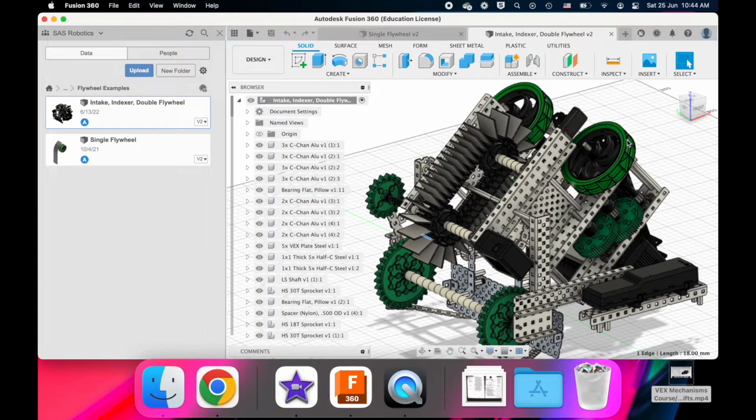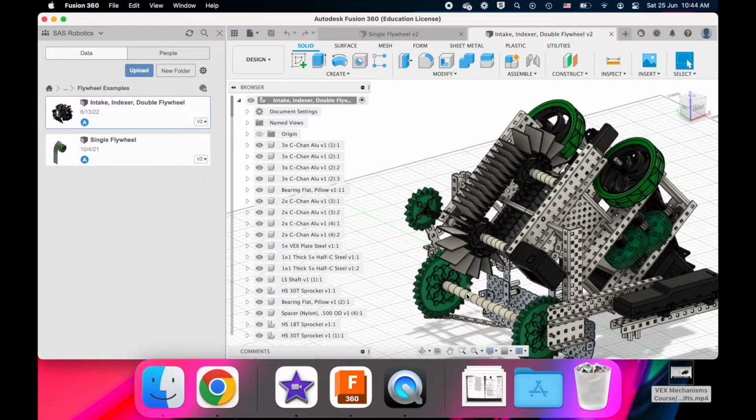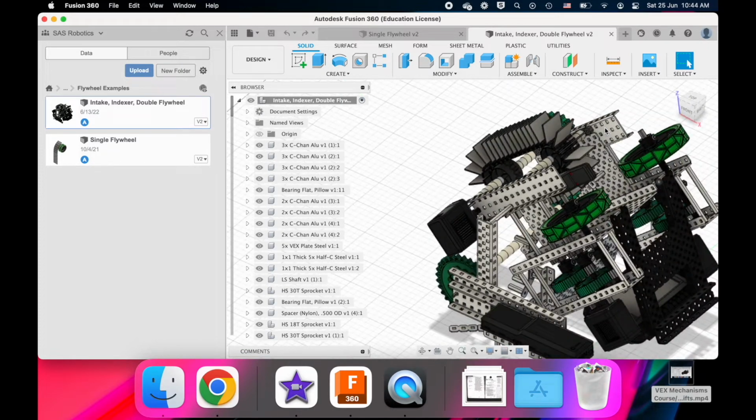And this year, for this game, for this robot, they had to pick up a bunch of yellow balls. You picked up the yellow ball in one location in the field, okay? But you don't want to fire it immediately necessarily. You want to position your robot in a more advantageous position before you shoot the ball. So you can store balls usually in your indexer system and control when balls are brought from the beginning of your indexer, which is basically the location it shares with the intake, to the end of the indexer, where it shares its location with the flywheel.